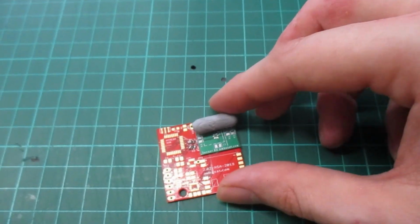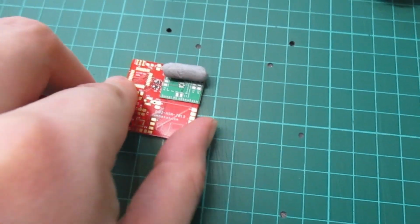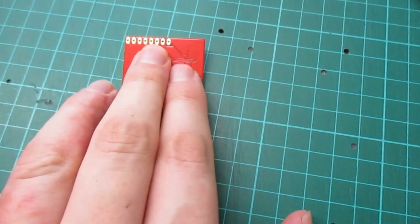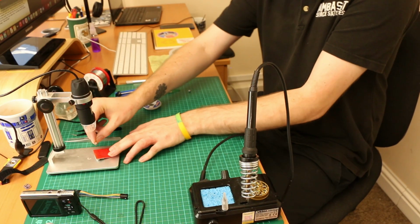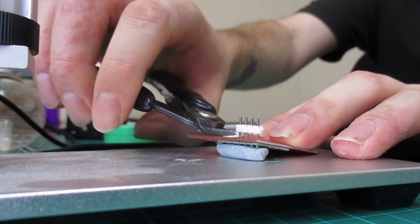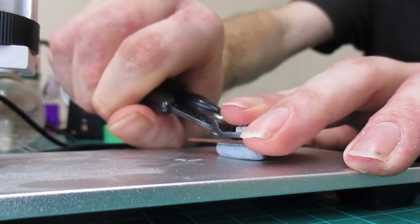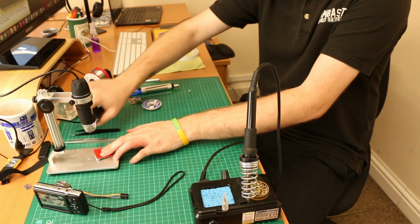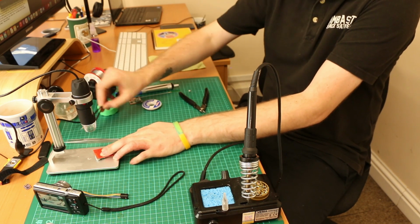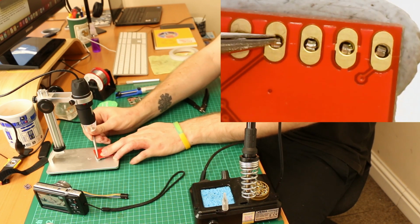This is then placed over the contacts as seen here, then turned to expose the rear, where on this particular board a flush solder is desirable. Take care not to compress the sausage too much and insert connection pins like so. Because I'm after a flush solder, I am cutting the pins as close to the board as possible. Once cut, notice how I take my tweezers and tap any protruding metal further into the BlueTack, just to embed slightly.